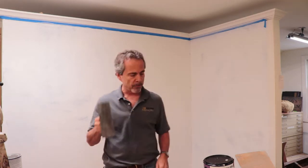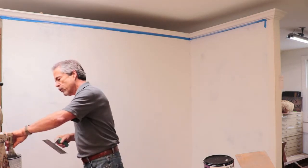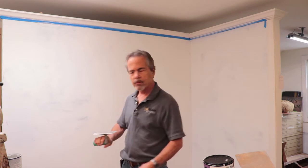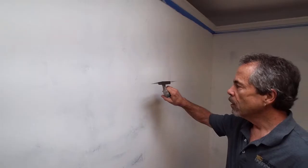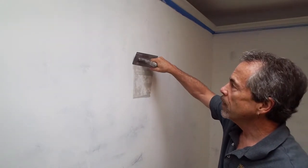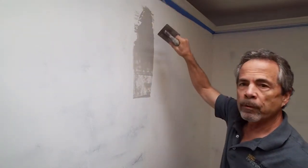Before you commit yourself to a large wall, I'd strongly encourage you to practice first with your trowel. I'm going to demonstrate with a small trowel — this is approximately eight by three inches. It has a somewhat flexible stainless steel blade. The main trick is in loading the blade. You just want to work with a small amount of material to begin with. Put it right in the center of the blade, leaving a gap at the bottom and the top — maybe a finger's worth of texture on the blade. Start with the blade angle up about two fingers worth, then pull it up and gradually lower the blade as you're pulling it up. You'll release the material.